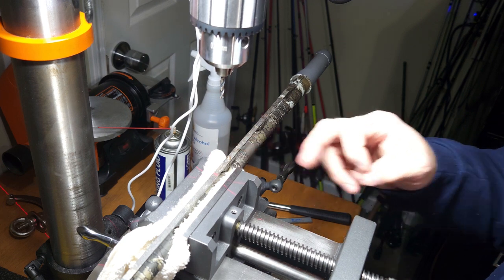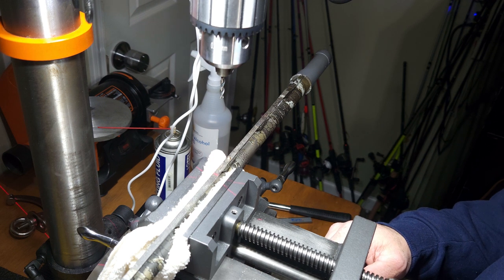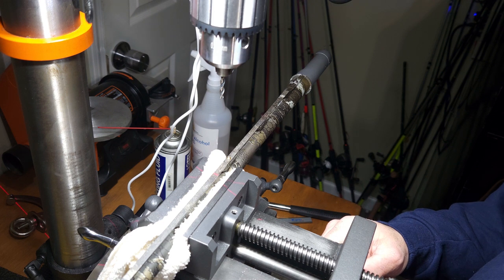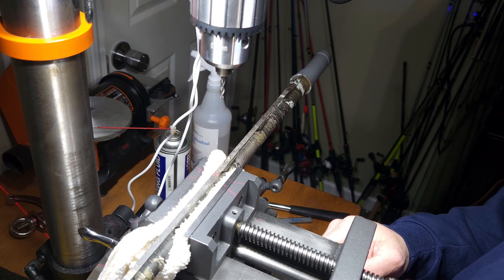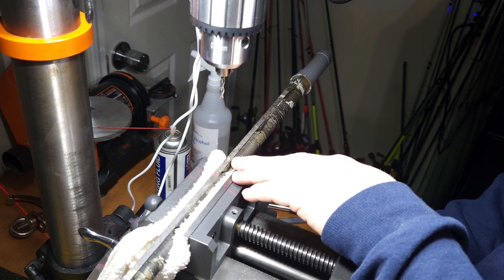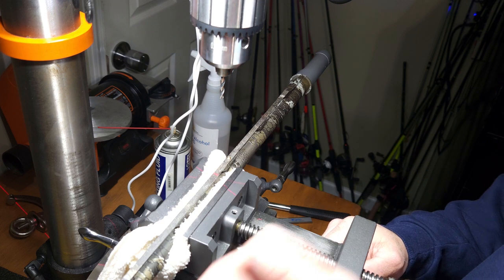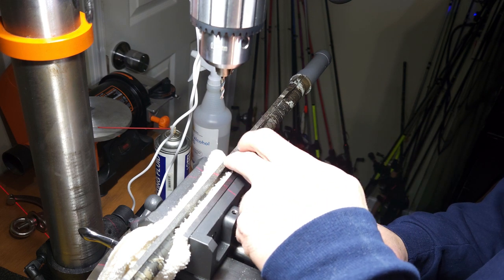And what you have to do is once you drill through and get your bead in place, you have to go in the inside of the muzzle with a needle file and clean that threads up. That's where everything that's went through. You've got to file that down till it's flush with the barrel. You would Loctite that in place as well, and then go inside and clean up any remaining Loctite from inside the barrel if any happens to drip through. That way, when you fire down the barrel, your shot's not hitting the threads on the bottom of your sight bead and deforming your shot and damaging your sight bead.